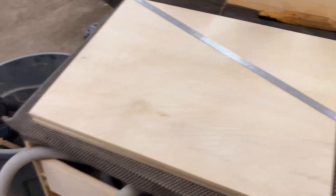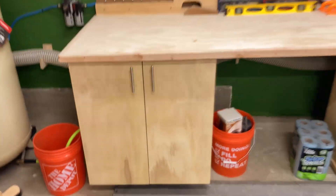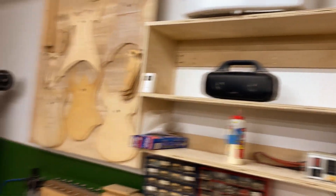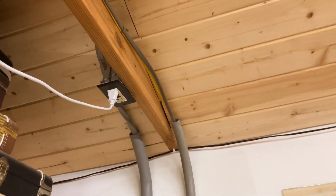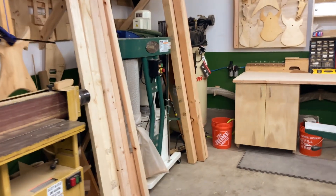Finished sanding these things up. I'm just waiting on some hinges — I'm doing European hinges, just like these guys here, the type that are recessed in. I'm going to put doors on that. The inspector — everything's good. He looked around and looked at everything. The only thing he didn't like was that there are no bushings up here at the top where it's PVC to Romex, but it's no big deal — he passed it. He said it's fine, and everything else looked great as far as all my wiring and my hard wiring to my machines.